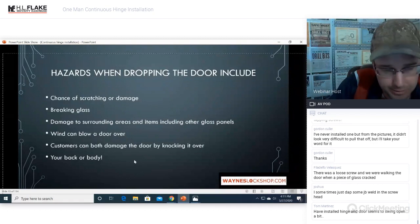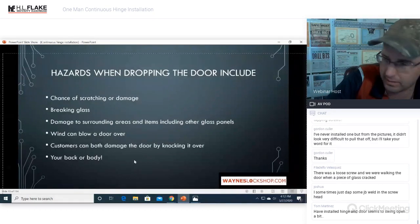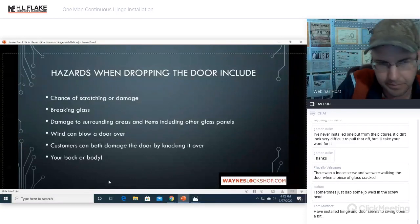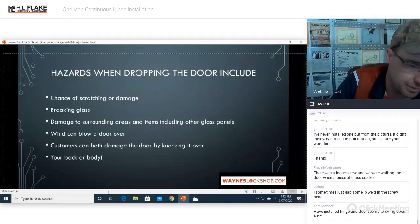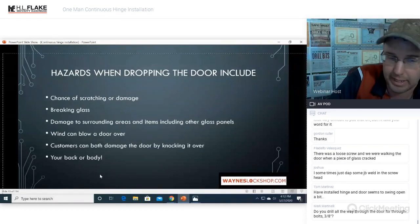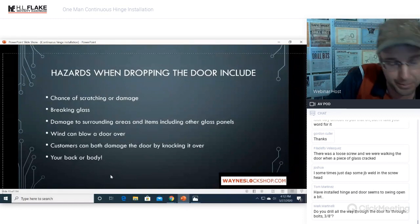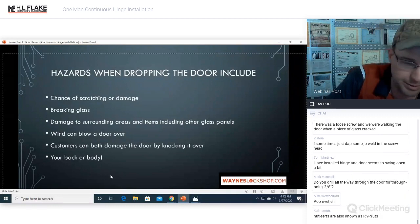If you have concerns, then add the pin and Torx or security screws on top of it. That's the method behind that. If you have the option to add a through bolt, you could add a through bolt. It's going to be up to you, but they are pretty difficult to remove, and it would take at least 10 or 15 minutes to get that thing peeled off of there and undone. By then you're going to be using power tools, and people are going to notice. You're going to be using a lot of stuff that's very loud and noisy. It's not a covert entry.